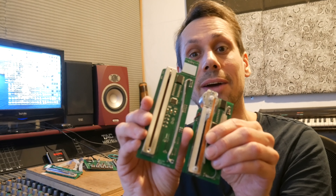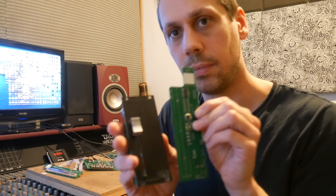Side note — people keep asking me: is there a 100mm fader? Yes, there's a 100mm fader in the Rucco line, it's on the rucoproaudio.com website. There's going to be a screen on that one when it's assembled. As you can see, it's a bit longer than the standard 60mm fader — it does require a 4U case; this is a 3U case and that takes a 60mm. The 60mm gives you a lot of what you need, especially if you're doing trims and trim rides — most of the resolution is fine there. So whatever you prefer.